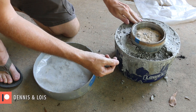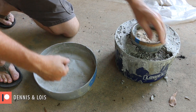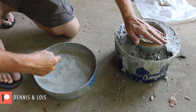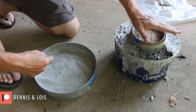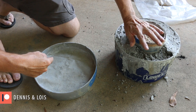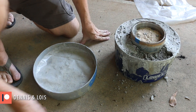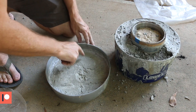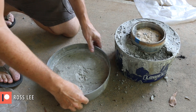I'm not feeling that same brittleness all the way around here. That would indicate that I had too much foam in the matrix and not enough cement. So when the foam dissipated, there were air gaps in the cement that then formed weak spots.